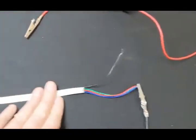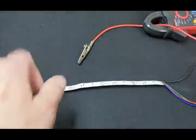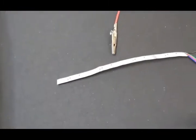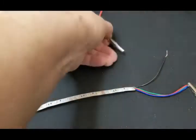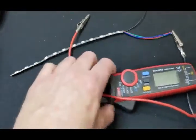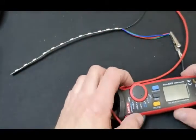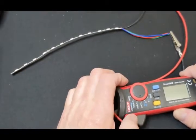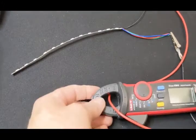We're going to illuminate the LEDs at 100% and then with just the red channel to see how low the reading will go and what the readout looks like. We'll turn it on, select two amps AC/DC — you don't have to search for the range at all. Then we'll switch it to DC and zero it out. Ready to go.